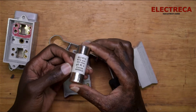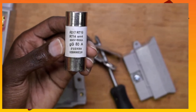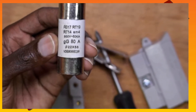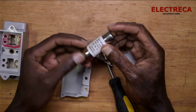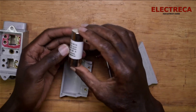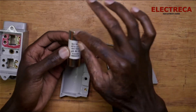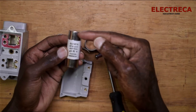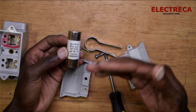This is how your fuse cartridge looks. They have written the rating — voltage plus current — and a number on it. The body in the middle is ceramic, and the conducting parts are these two ends. Inside there is a fuse wire that links from one end to the other. When excessive current is drawn, more than it can take, the fuse wire blows.